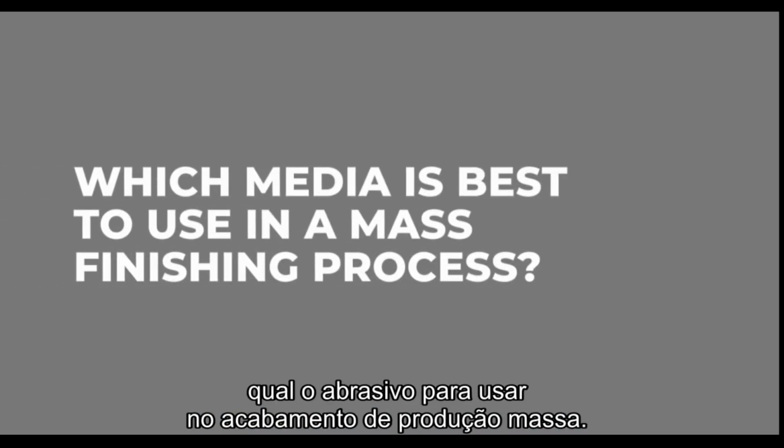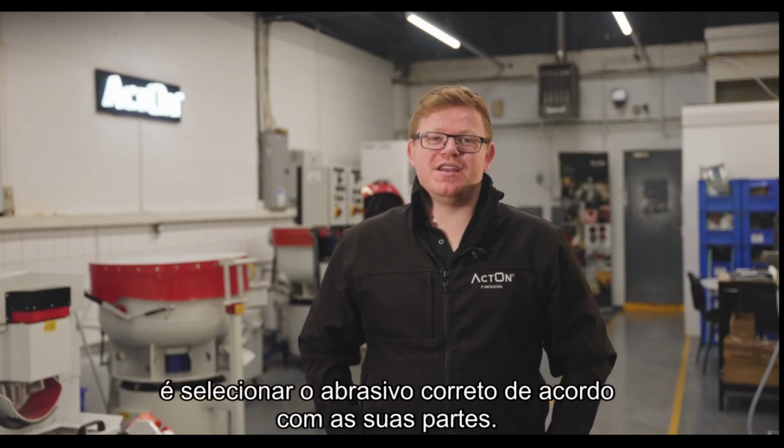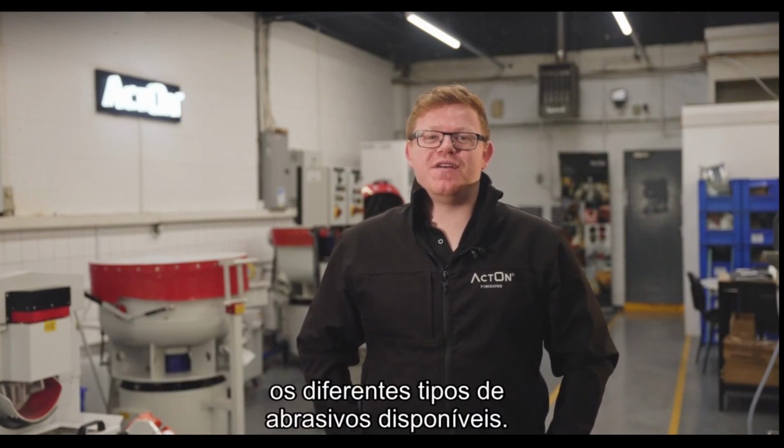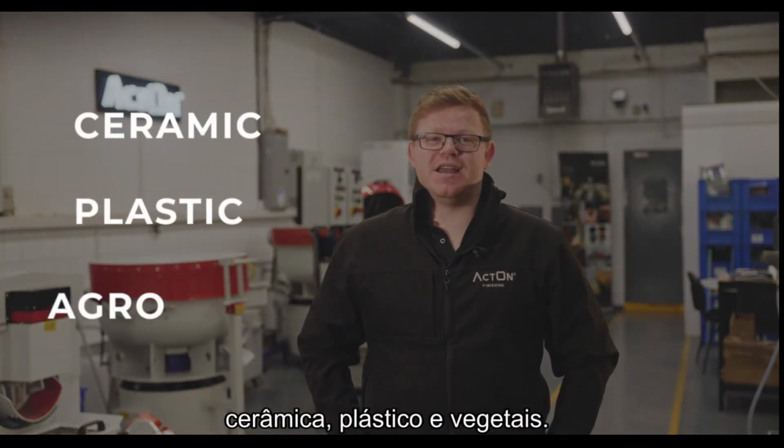And today I'm going to talk about understanding which media is best to use in the mass finishing process. So one of the key factors in any mass finishing process is to select the correct media according to your parts. Firstly, it's important to understand the different types of media that are available. There are three main types of media: ceramic, plastic and agro.